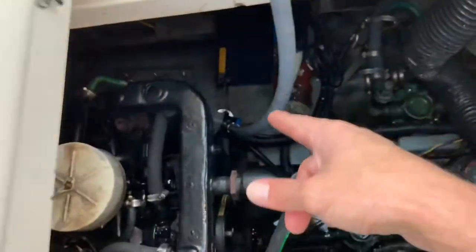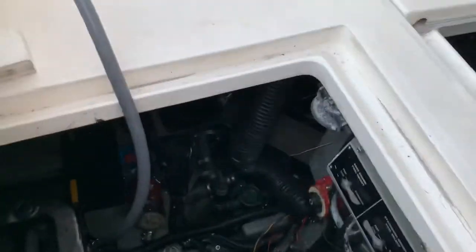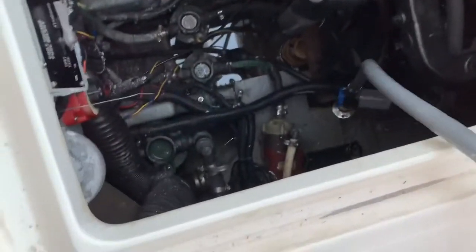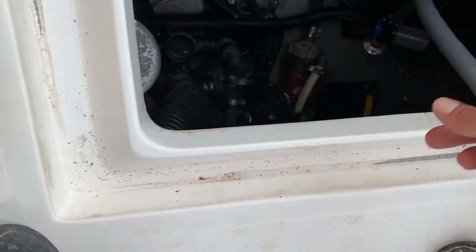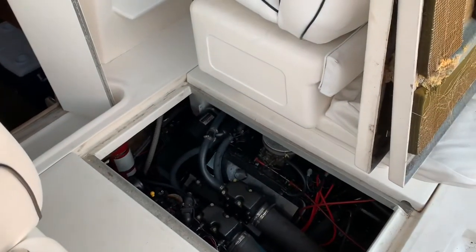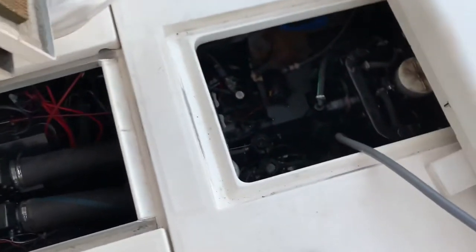So what I do is, with the engine still running, I just go and close the shutoff and quickly unhook the water, letting air go through the system. I just let air go through — that gives me enough time to get to my key and turn the engine off. You have to do that because otherwise you put too much pressure on the system, and I don't trust that breather. As I go to the ignition switch, there's still enough water in the system for the impeller of my water pump not to run dry. I've done it this way forever and never had impeller burnout.